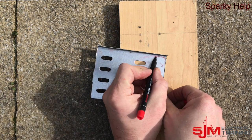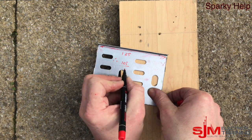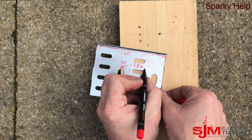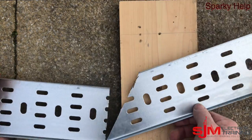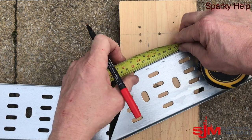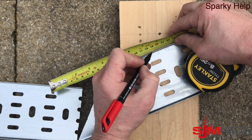And then we're going to measure this, and this one here is 125. To find how much you need to cut off for the lips on the other one, you do 125 divided by the square root of 2, which is 1.41. So 125 divided by 1.41 comes out to 88.4mm. Remember, everyone has a calculator nowadays — it's called your phone. There's our 100mm either side, there's our diagonals that we would do. So if you'd have known it up front, you could have just measured it. I'm just going to measure 88.4 on from my diagonal on that one, because that's the one I've cut out.